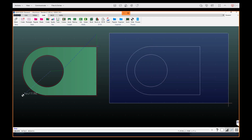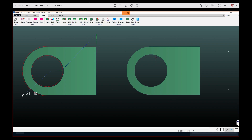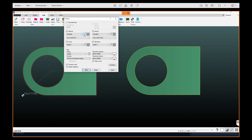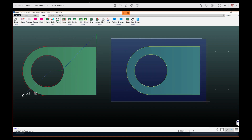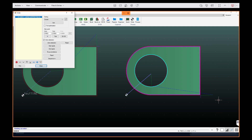Next I'm going to create a part — I'll highlight my CAD geometry here and hit enter, and it's going to color in and give me a preview of what that part might look like. Next we want to path this part. In our contour path, this is where we set our lead-ins and lead-outs. We have a bunch of control offering different types of piercing styles: linear piercing, circular dynamic piercing, air start piercing. You have an incredible amount of control here to fine-tune tool paths and lead-ins on different types of materials. I'm going to hit multi-select and highlight this entire part, and it is going to auto-path my interior contour and my outside contour. You'll notice a phantom tool line already offsetting the width of my tool diameter. Then I'll highlight again and set my start point or origin — by default I've chosen that at my lower left-hand corner.